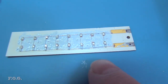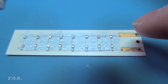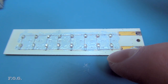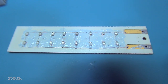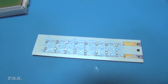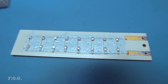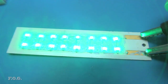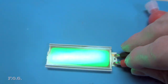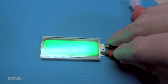I've finished rebuilding the backlight. I ended up using two green LEDs in series with a 5-ohm resistor—these green LEDs run around a 2.8V drop each, which is technically more than 5V, but you can get them to light up at 5V. Current is just over a milliamp per LED string, so the whole thing consumes around 10mA, which is pretty low. The heat-activated glue worked well to stick the LEDs in place. The light has a bit of blotchiness—possibly due to LEDs being slightly off angle or performance differences—but it's quite usable.